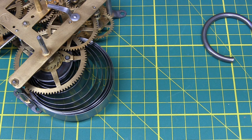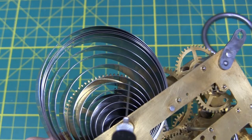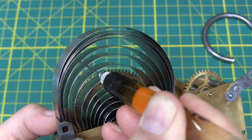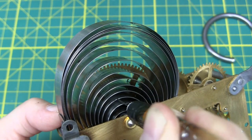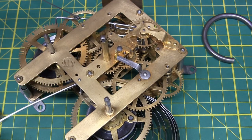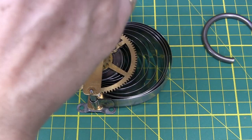Once the spring is relaxed and open more, that's when you can just put some oil in here with this needle oiler — it doesn't take much. You just kind of dab it in here, dab it in there. Then when you wind it up, it'll compress and push that oil all around. You don't need too much — you don't want it dripping. When you wind it up, that'll compress the springs and distribute the oil.